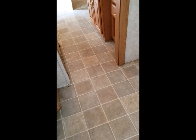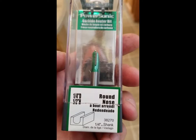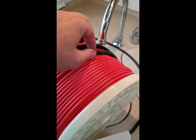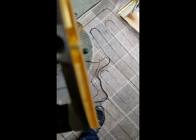So we're going to take a quarter-inch round-nose router bit and gouge out a quarter-inch slot in the floor where we can then put our heated wire strip. What we should end up with is a nice level surface where we can put laminate on afterwards. We've got our router bit in place, set up at a quarter-inch depth, and we're all ready to cut some grooves. All the lines are marked out in pen.